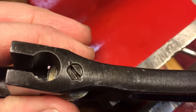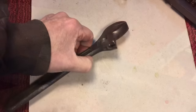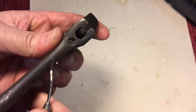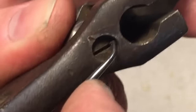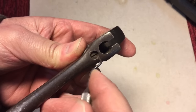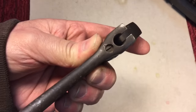The only way you could straighten it out is to apply a little bit of heat to soften them up and then slowly back out the screw. I'll show you the steps I go through one by one when I first get a wrench and want to take it apart. The first thing I do is look at the screw, make sure it's not mangled, and I take a dental pick. If you don't have a dental pick, you can make something out of a bent pin or whatever. The first thing you want to do is scrape out any gunk in that slot, because you need a good purchase on that screw if you're going to get it out. Then go around the thread to make sure there's nothing around the corners.